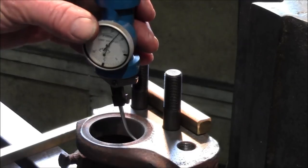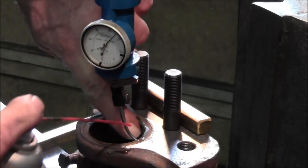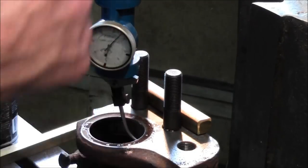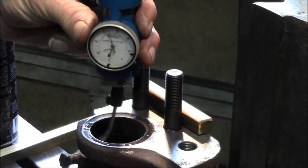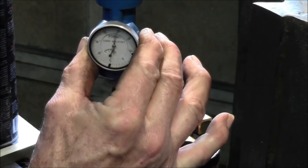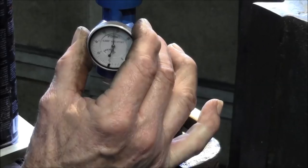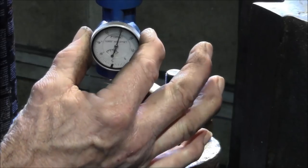Okay, I'm using a coaxial indicator here to indicate this bore or center this bore, and I like to go ahead and put just a little bit of light lubrication on my bore when I spin this with the machine. And this indicator is made to go ahead and rotate the spindle by hand, or I turn on the machine and then you can crank both your axes to minimize the flexing or the indicating back and forth until you minimize the amount of run. And you can see when I go past it and then down to it, and then there's zero.